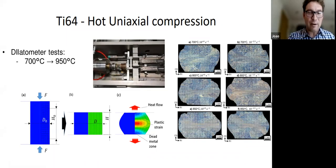It's beautiful. However, you end up with these ugly ducklings of samples because of the deformation, and not just because of the gradients in temperature, but also because the structural units inside, so the laths and so on, are quite big compared to the size of the specimen. So often you end up with kind of skewed specimens because of the local anisotropy of the microstructure.